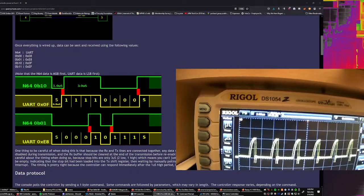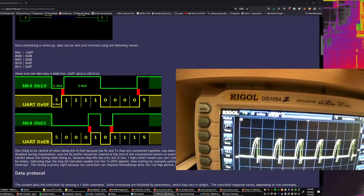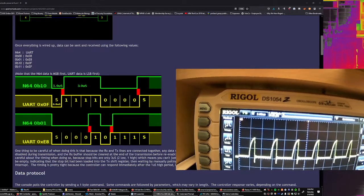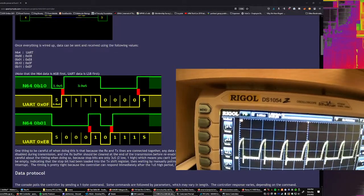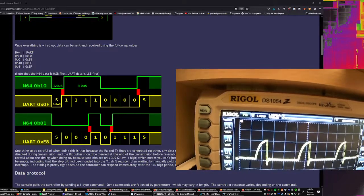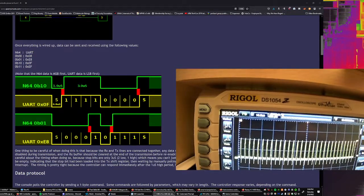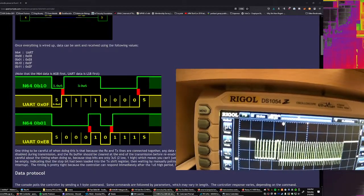And they actually get worse over here when you start trying to look at the data, and it's wiggling around because of the way that the oscilloscope is picking the start point. But that's not what you're supposed to see. You're supposed to see a nice sharp angle on those bits. And so there's something funky going on with the way that the polling signals are going back into the USB control thingy.